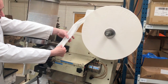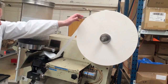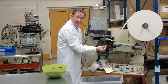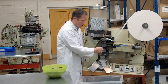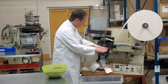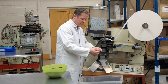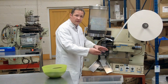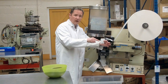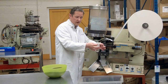So that's our string of sausages which gets sealed, and then that's the tea bag that's produced at the end. The way it's sealed is these two heated rollers — very hot — they've got grooves in them. They push the tea bag paper together and the heat-sensitive gum that is on one side of the paper is then activated. The paper is glued together and so on the three sides of the tea bag you end up with these characteristic grooved seals.